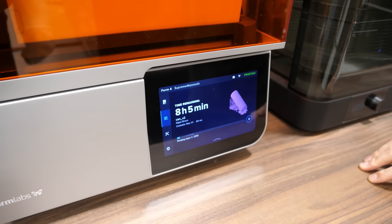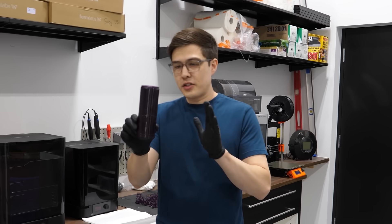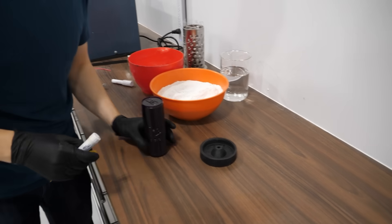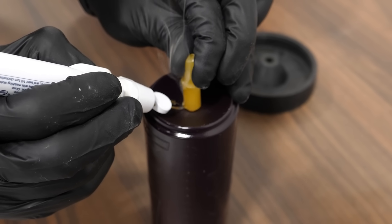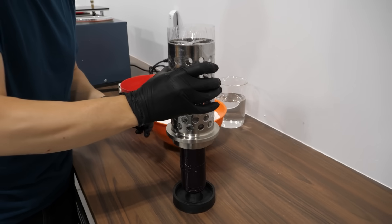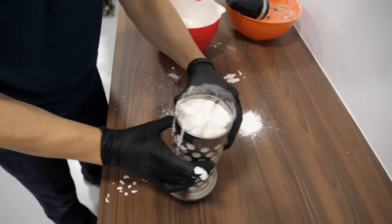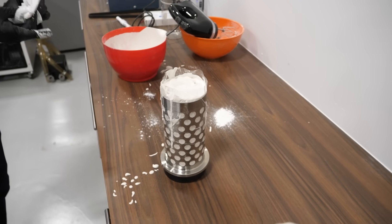Hopefully tomorrow we will have a beautiful wax can. So we have our waxy plastic Red Bull can and now we have to turn this into a plaster mold. What we need to do is attach this wax sprue to it — I'm just trying not to screw this up royally. And we can add our plaster to it on all the edges.